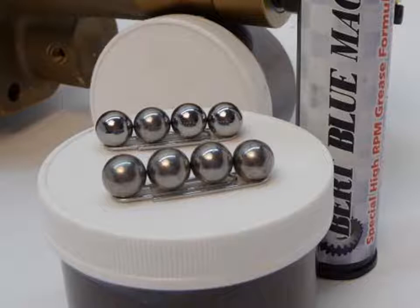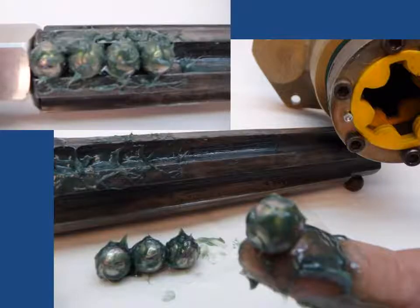Here's a closer evaluation of the Burt Blue Magic special high-RPM grease formulation in action after one year of use. Here you see the Burt Blue Magic special ball spline grease. This is a calcium sulfonate complex. You will see a special tackifier package. This is a light and fluffy type grease with science technology inside of it, where it has a special tackifier. All greases are tacky to a point, but this has a special tackifier additive which allows the grease to crawl when it's cold and then adhere the additive packages of the oils and the anti-seize and anti-friction properties directly to the surface of the bearings and the spline. That is why this has the performance that it does. Furthermore, 100% waterproof.